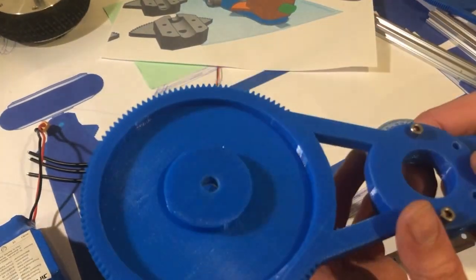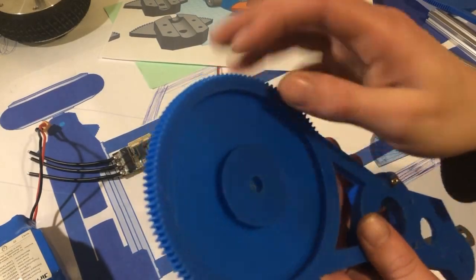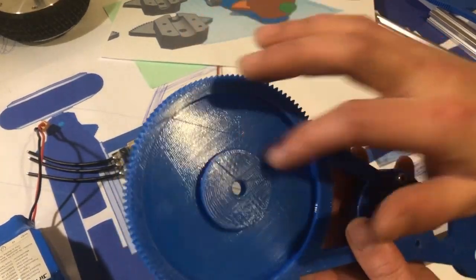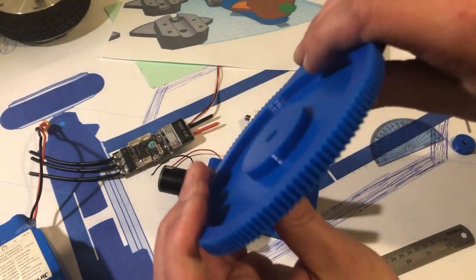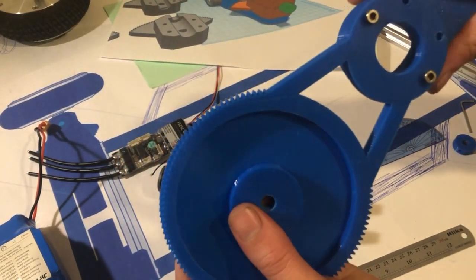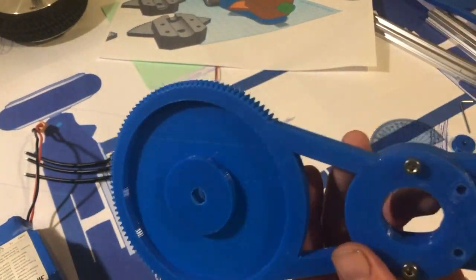There's probably not going to be much strength in these parts so I've got to see if I can leave as much gear there as I can. I might even have to support it with some hot glue or something just to give it a bit more rigidity when it's cut, because it was basically made for fast print mode using as little material as possible.